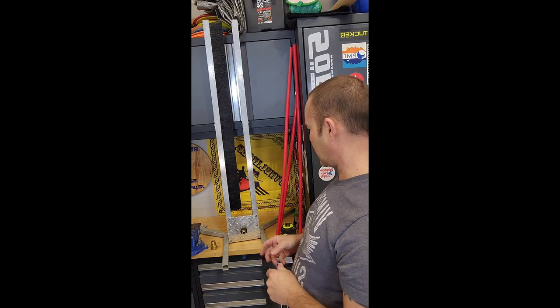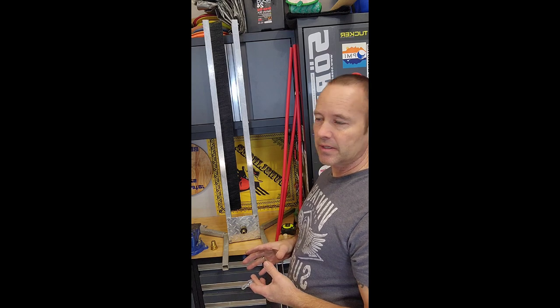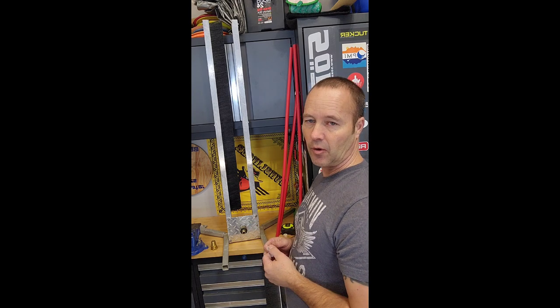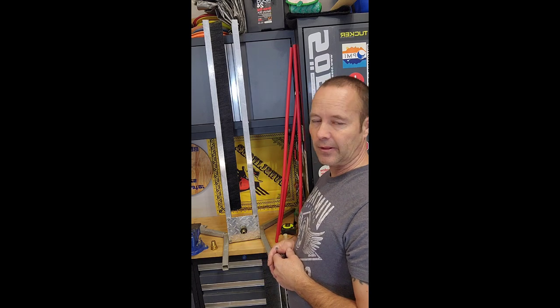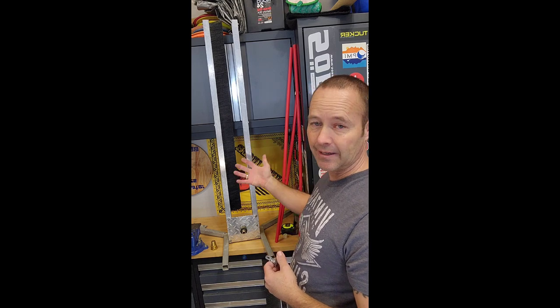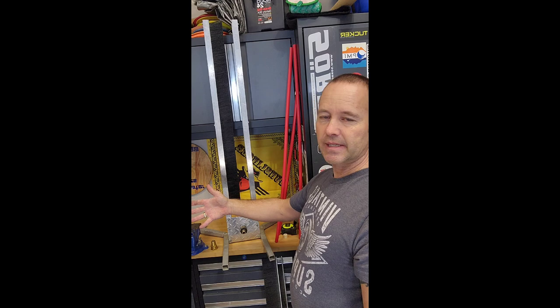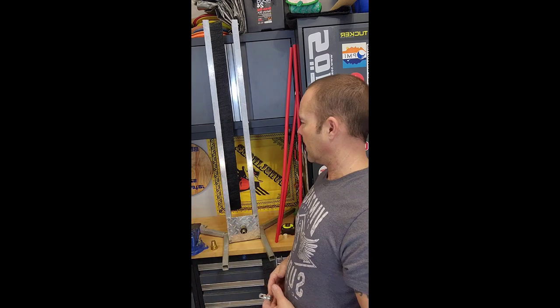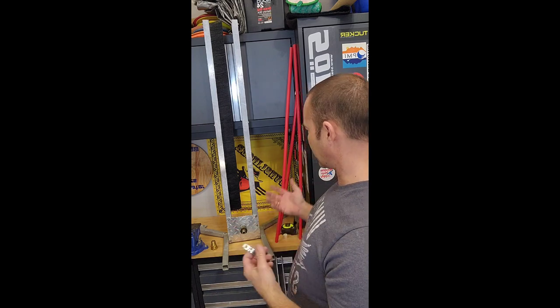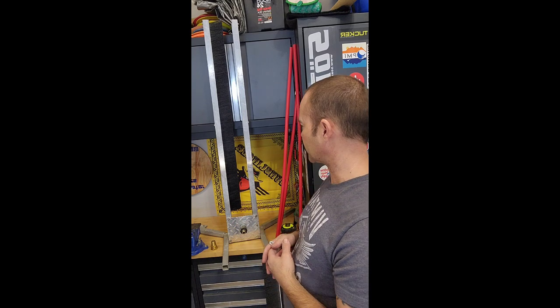I'll put a parts list online attached to this video. If you have any questions, contact me on the forum and we can get you a parts list or direct you however you need. I'm happy to help anyone who wants to build one of these screen cleaners. Screens can be a battle — flush with water and agitate them at the same time, tap them off, and let them sit next to the house until you're ready to install. I just can't justify paying over six hundred dollars for the IPC 350s or the Aztec version. I got into this for 150 bucks, and I don't mind building things. That's my DIY screen cleaner — Window Warriors Forum.